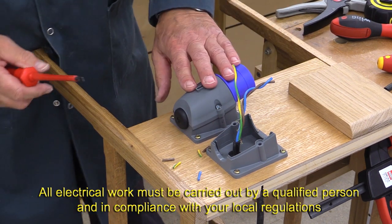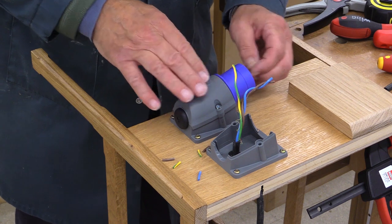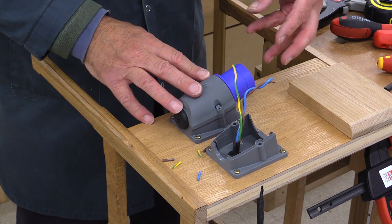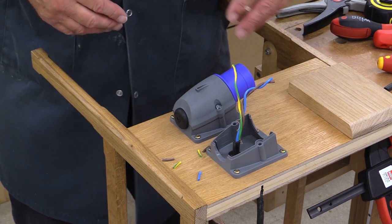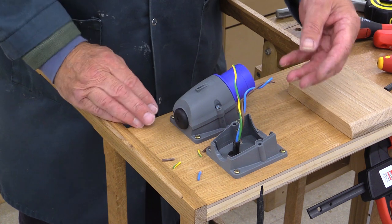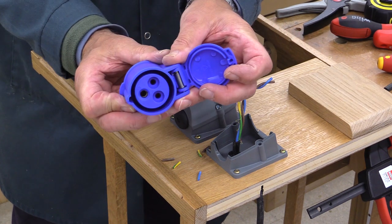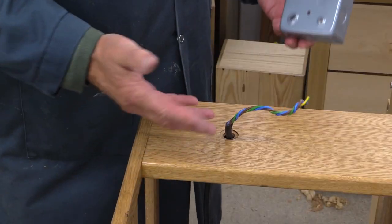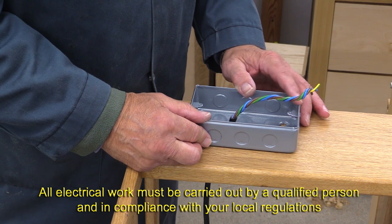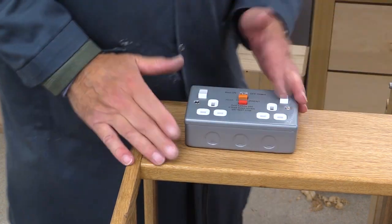So that's the first one done - the second one is going to be identical to this. My rationale for having the male connector here: this is the one where you bring your live in from the mains on site - it goes into here and this is the lower of the two because that cable's going to disappear on the ground somewhere. The cable going to here is the male one which goes to your motorhome or caravan, and this is the female socket - your power from here will go to your motorhome, caravan, or wherever. So all we now have to look at is what's going on at the other end, which is the socket for connection of the microwave or whatever you might want to use outside. And that's all those connections done.